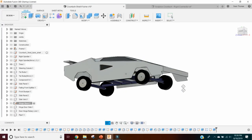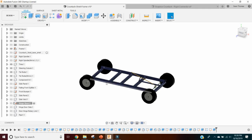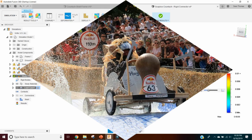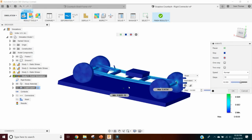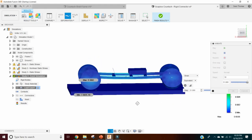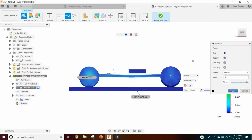I started the design process in this program you see here, and really the main thing I cared about was this frame. What I needed to do was make sure that that frame was going to survive some of the ramps you see in Soapbox, which leads me to this simulation right here, called an event simulation. If I animate this, you'll see that I've actually simulated this thing falling from about 24 inches, or two feet high, to get a feel for what that impact is going to do — because in the first Soapbox I tried, we actually had a catastrophic failure on a ramp and I don't want that to happen again.